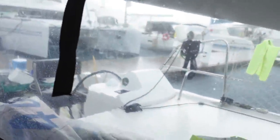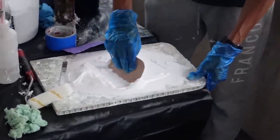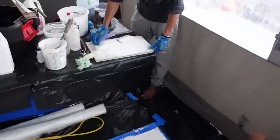It's just started raining, so we've closed all the covers. Now it's nice and cured. He's mixing up a little bit of the filler — the filler is gel coat with what they call talco and a little bit of micro spheres in it. That goes over the gel coat we just rolled, and then two layers of fiberglass on top of that.